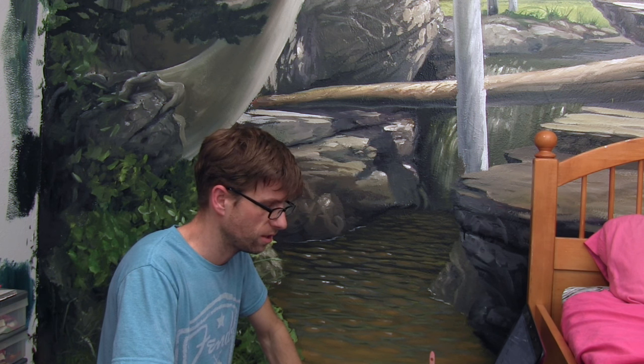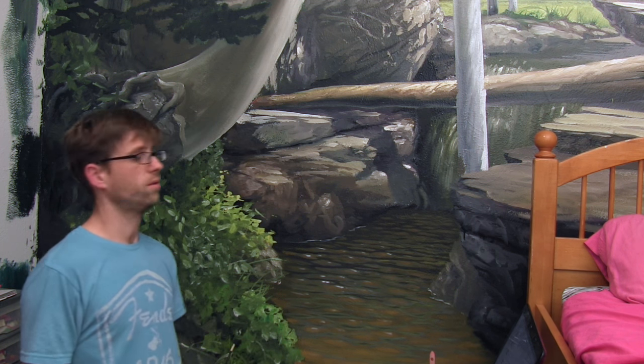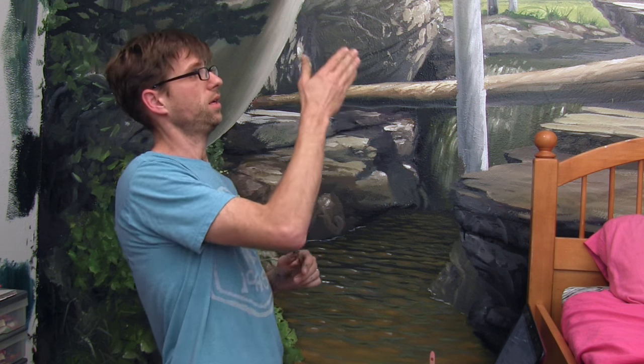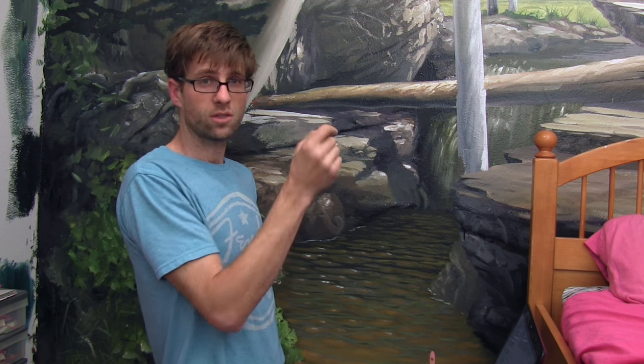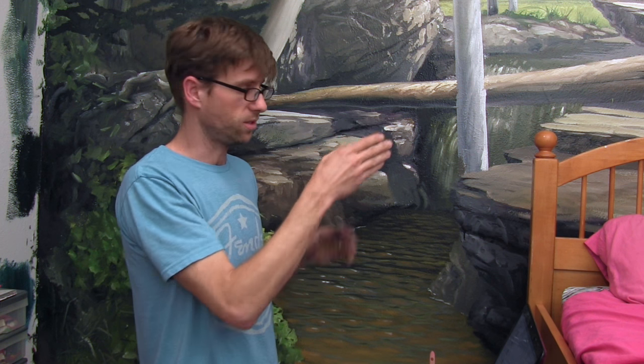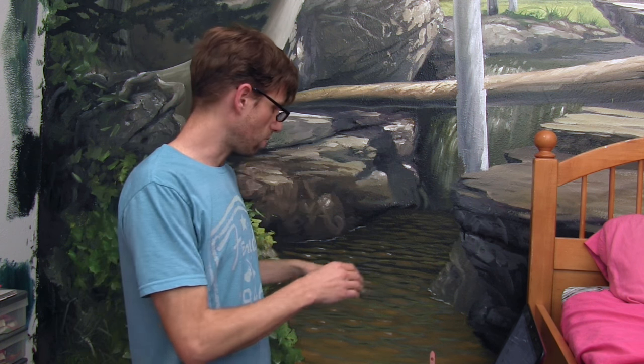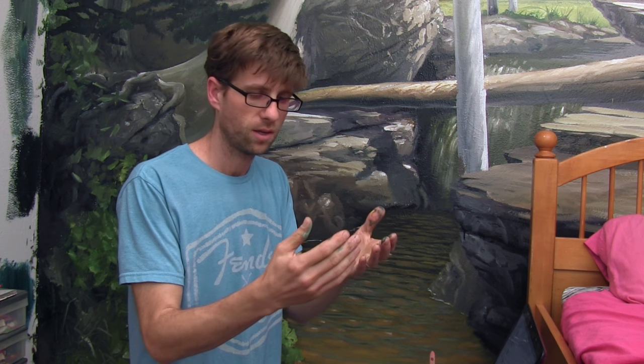Tsisori Tigerwolf says, "How do you keep your edges clear? I mean the corners at the carpet and around power sockets and stuff. Just really careful painting or masking them off or something else?" Well, on this one, you look at this edge here, that's as messy as it gets. But when I do want to keep them clean and cut in a nice edge, I just use a good cut brush. I was paint contracting for a long time, and it's the same way a contractor uses a brush with a nice clean edge to cut in a corner. I just do that with each color as I'm painting the mural. Yeah, it can be challenging. I do use tape. No shame in using tape. If you do use tape in a corner or on a floor, do a couple coats. Do the first coat lightly, and don't put all the paint on because it squishes under the tape.